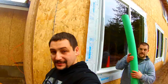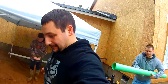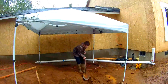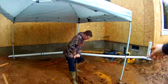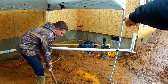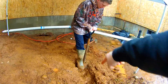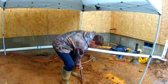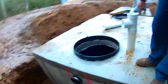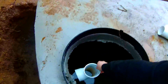We are getting ready to start plumbing the septic tanks. I've got Grant out here behind me — he is working on digging the trench for the inlet from the house. The inlet comes from the double sweep T clean-out along the red line to where Grant is, and it comes through a trench into a little grommet. Inside of there will be the T assembly, which comes with the tank, and that goes down inside of the tank.